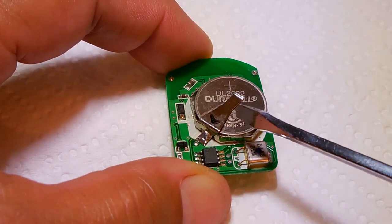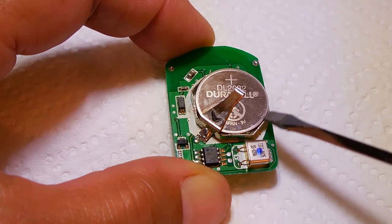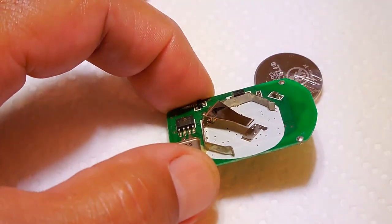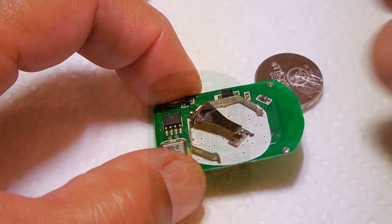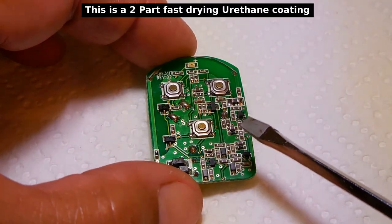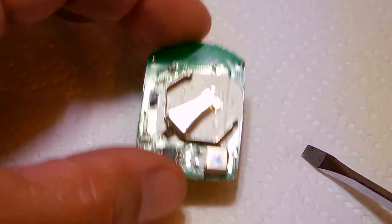On the back side I'm going to pop out the battery and tape up the inside of the connection on the positive as well as the sides and underneath. This connection is also going to be taped off. I'm going to apply two layers of a conformal coating — in this case it's going to be urethane — applied in two full wet coats on both sides.